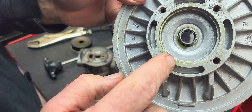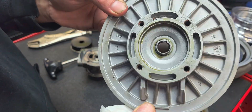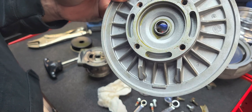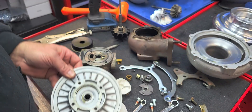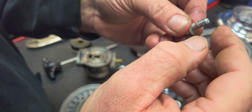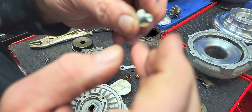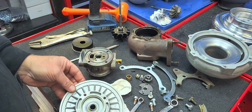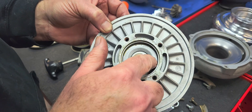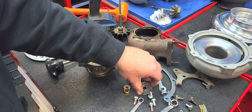Now, it could have come out of these screw holes when the unit was tightened up or when I loosened it — that's actually where it would have to come from, because glass beads don't readily stick to the surface of a relatively clean component. I'm going to look at the ends of these bolts. We've got glass beads on the bottom of the bolts — so I think that's a little bit of a false alarm on contaminant in the turbo. I'm not saying some couldn't have gotten in there, and it is in the pocket area inside the oil path, but it's not a large amount, so I'm not saying that has anything to do with the wear on this bearing.